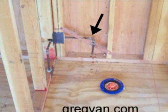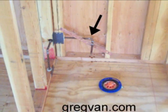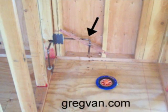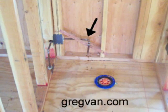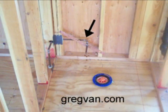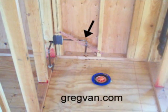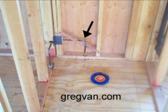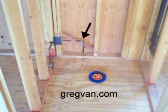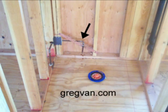I know the reason why, and hopefully if you have some experience, you do too. Believe it or not, there's a large wood beam underneath this wall, and you are not allowed to drill into structural beams. If you're a plumber, a homeowner, or a do-it-yourselfer, do not drill into a wood beam.